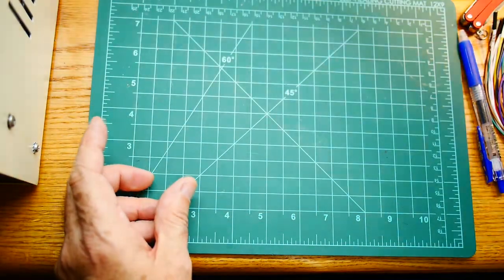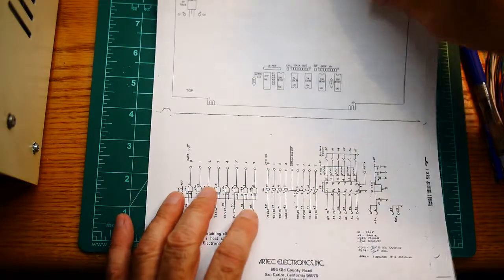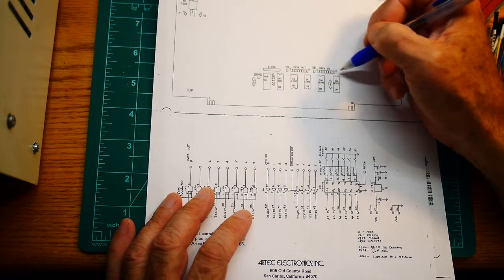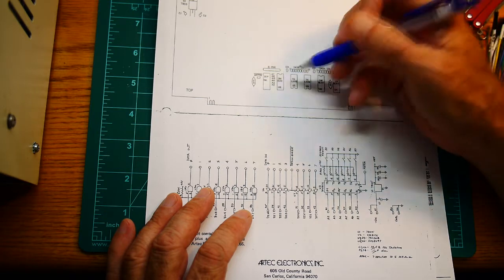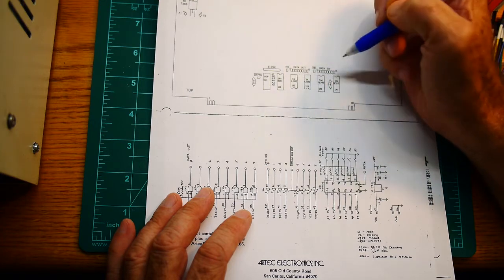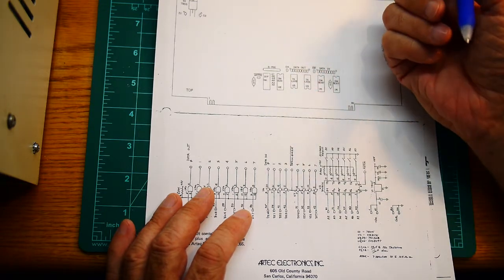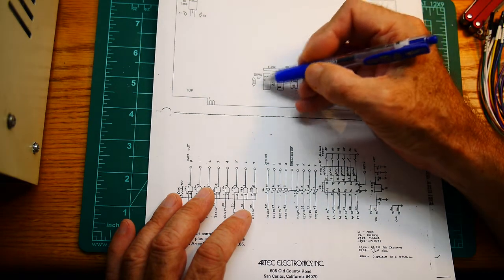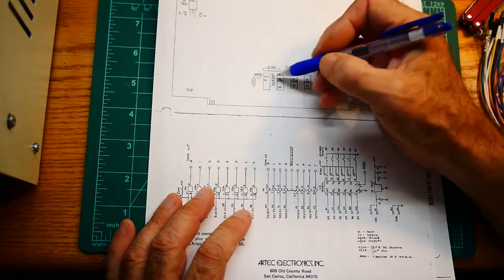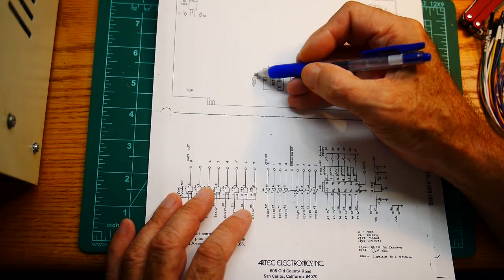Let's look at the schematic for this board. We have eight data out lines and eight data input lines, and we have buffers for those. If we want to send things to data out, there's an enable pin. And if we want to bring data in, there's a not-enable pin. This one's low logic, this one's high logic. And then the other thing this provides is a way to look at addressing and see if we are at the right address or not. You can have these DIP switches closed to a certain pattern — if you match the pattern, then it outputs the signal called not-match.